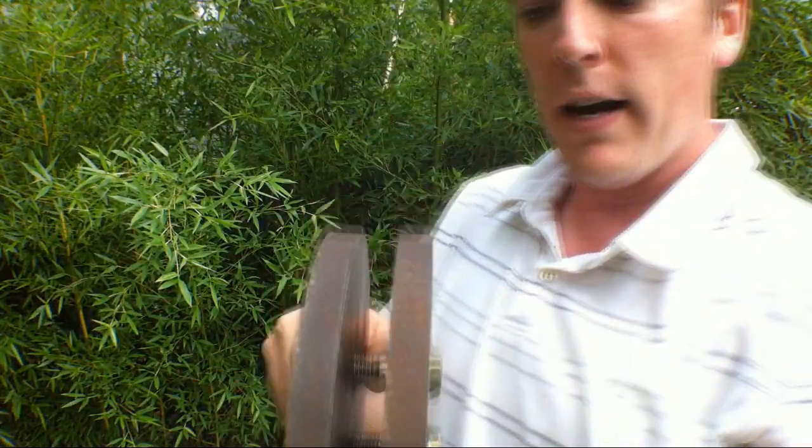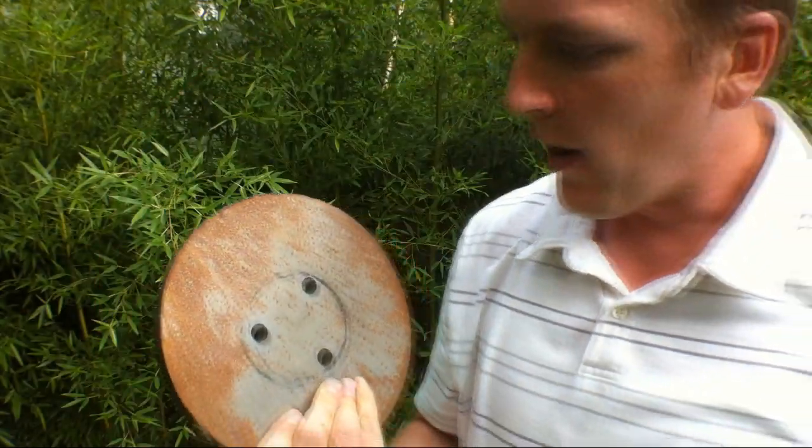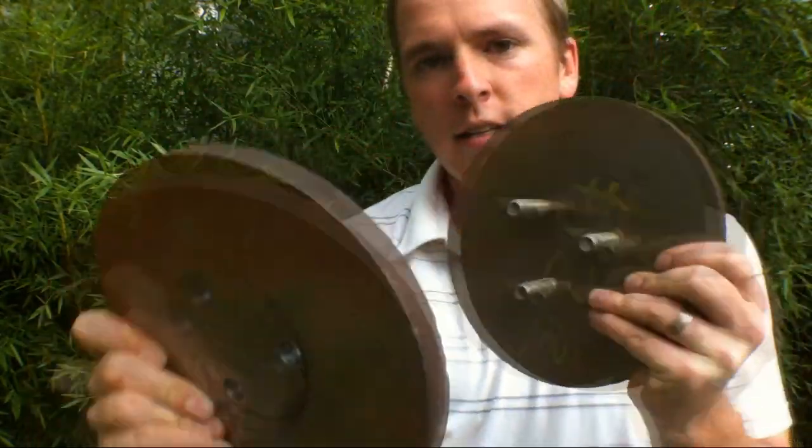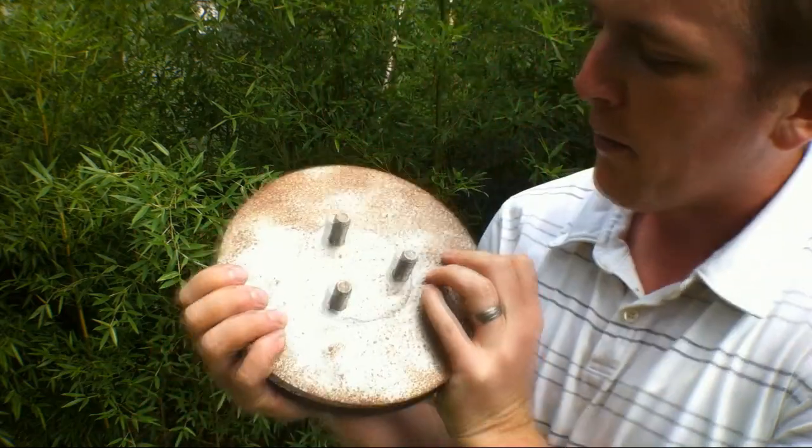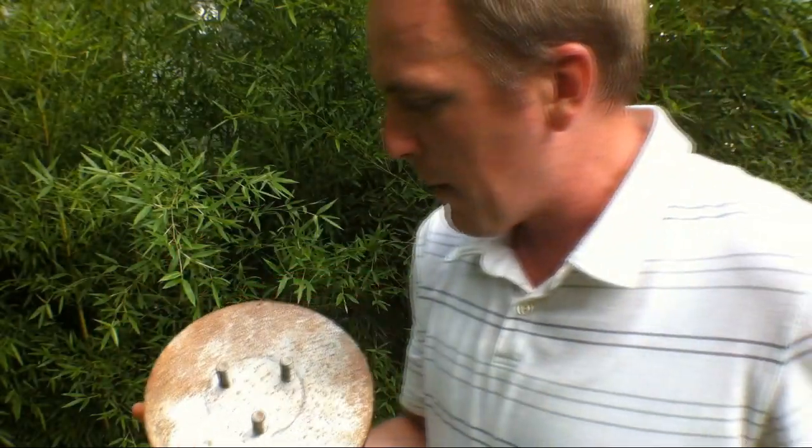The plastic is just rough and wavy — I guess it's just part of the plastic manufacturing process. I racked my brain, went up to the metal shop looking for a giant eight-foot C-clamp but couldn't find one. So I thought I'd make my own tool to iron the plastic out by heating it up. I found these two plain metal plates and thought if I get holes drilled and weld on some bolts, tighten it down while heating it with a torch, it'll iron the plastic out. I went to the machine shop, paid 20 bucks, and got three perfect holes drilled — and we had a plastic vise that worked.